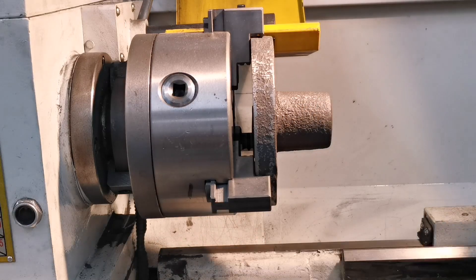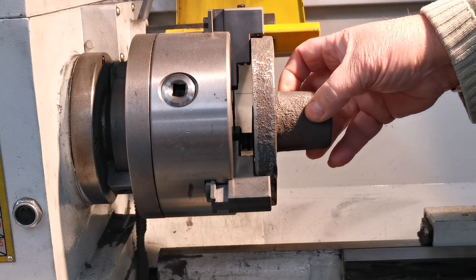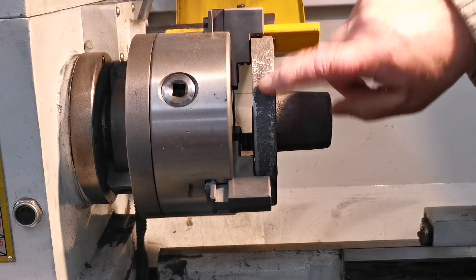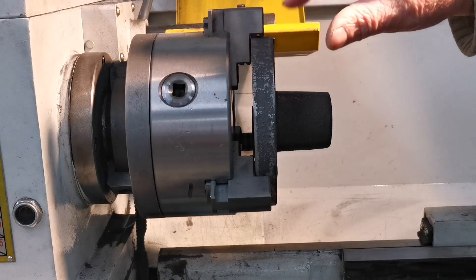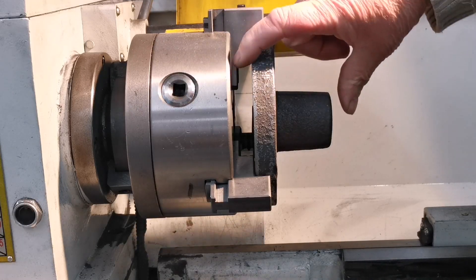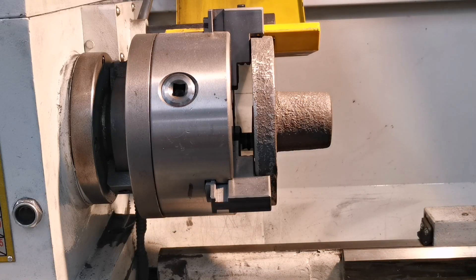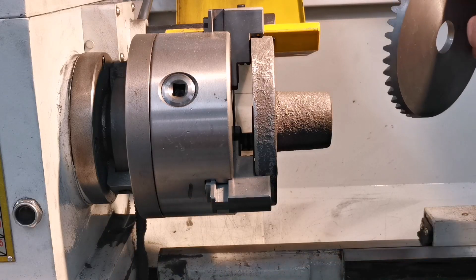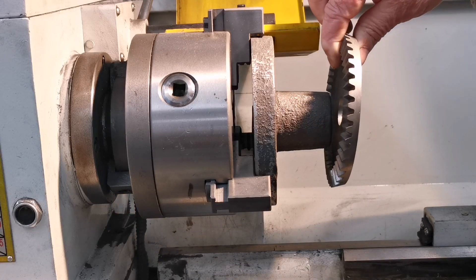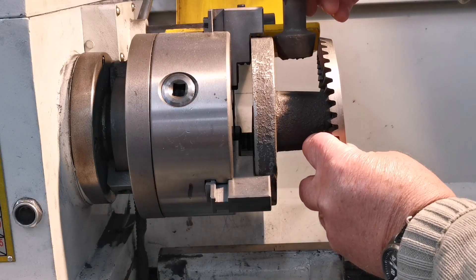Next I'm going to turn up the second half of the differential gear. First I'm going to round this off a little bit, then turn it around in the chuck so I can skim the back off and turn it down to diameter. Then I'll turn it back round in the chuck to machine the proper sides between the back face and this face. When that's on the axle, this one fitted on the wheel will be there, and when we machine the bevel gear they'll be in between.